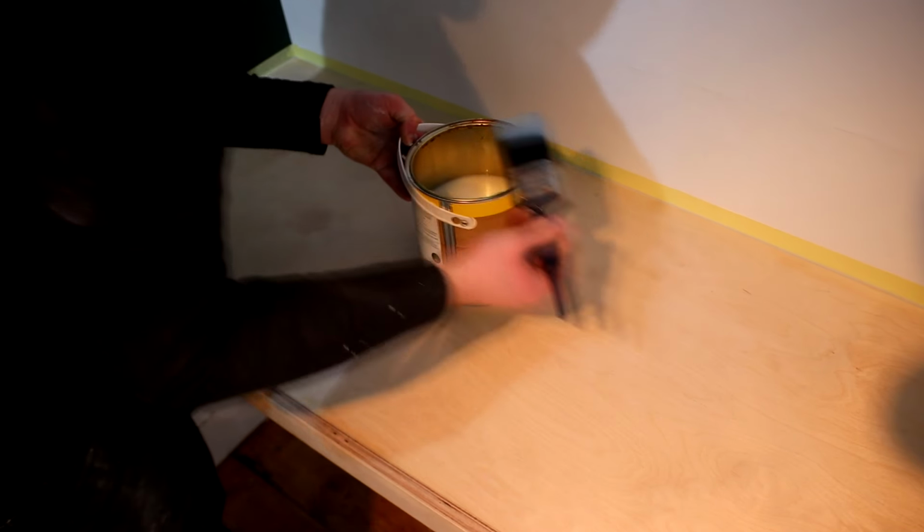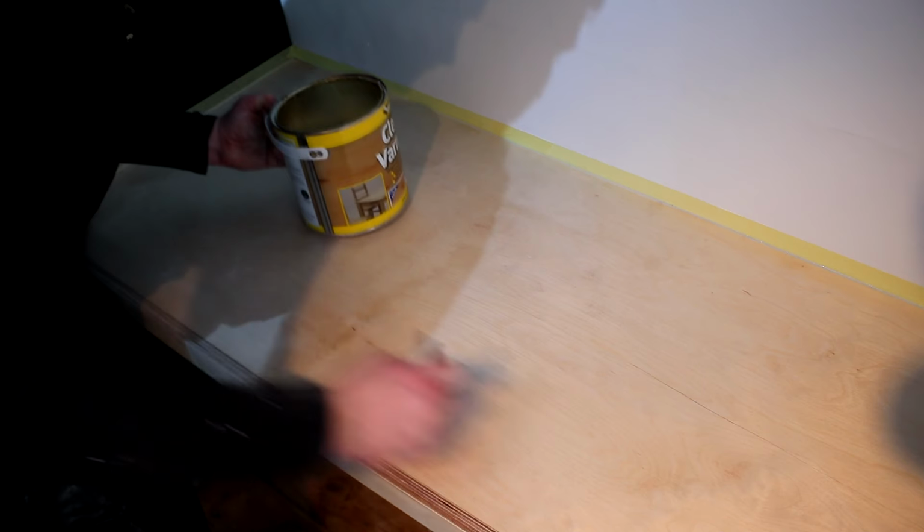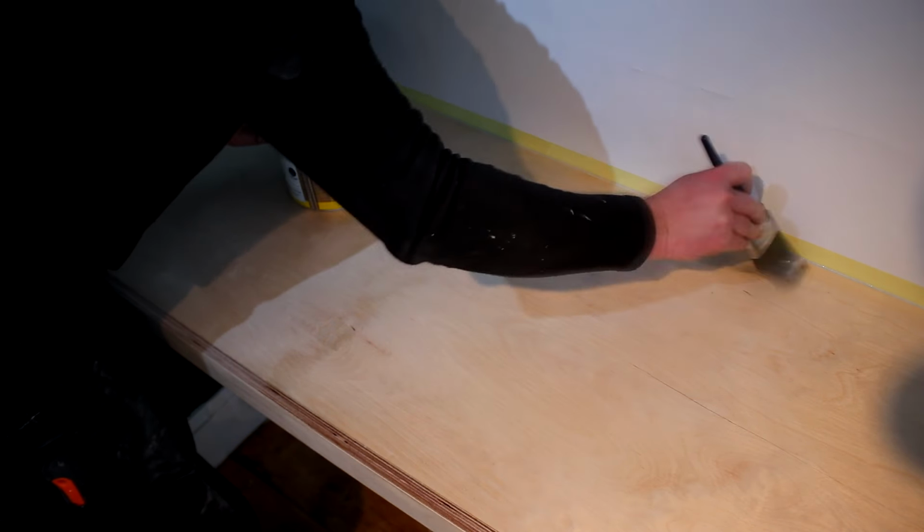I applied some water-based varnish as finish for the shelf. This will seal the wood and give it a nice satin sheen and make it more hard wearing. I'll leave a link to the stuff I use in the description box below.